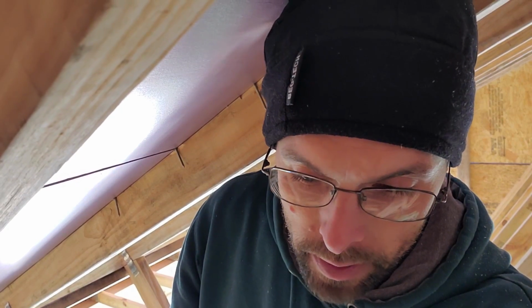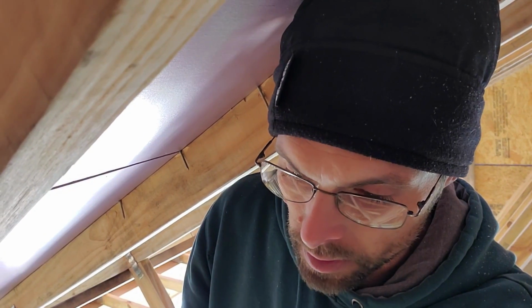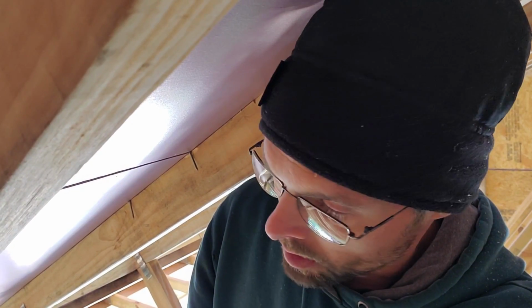So get that done. I've got to start running plumbing in the master bath. I think all my wiring is run to where it needs to go, so that should be done for foam. I've got to run my plumbing, and finish the chimney, and put taps to the outside for our exhaust vents, our ERV. I've got to put a hole for the condenser lines for the air conditioning system, which went with a Mr. Cool ducted mini split, 4-ton. To do the whole house, and it has 4 smaller units, 2 1-ton units and 2 3/4 ton units.